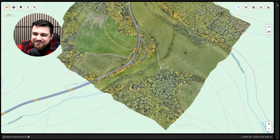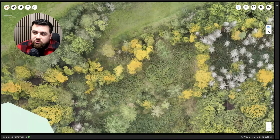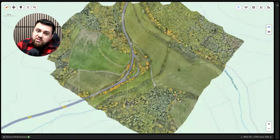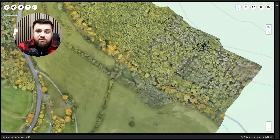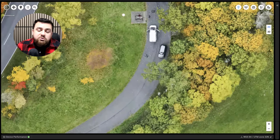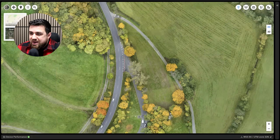Visually speaking, these checkpoints are hitting the point cloud and they seem to be matching vertically. In just a second I'm going to show you the quality reports with the vertical difference between all of the checkpoints. But before that, I want to look at the 2D ortho map generated using those 200 megapixel cameras. Zooming in, we can see an insane amount of resolution in these images — and remember, we flew this at 100 meters above ground level. With older LiDAR sensors that had 20 megapixel cameras, you would need to fly much lower and slower for this level of resolution. Flying at 100 meters above ground level with 200 megapixel cameras, we were able to achieve one centimeter per pixel resolution. This dataset looks incredible.